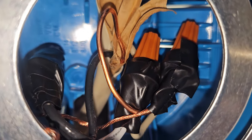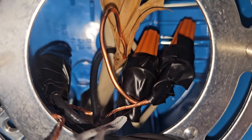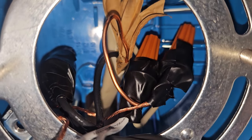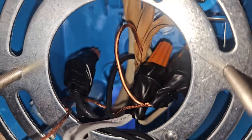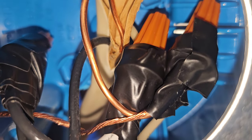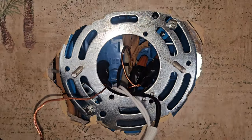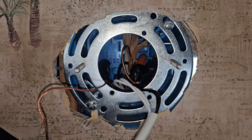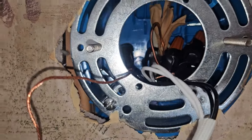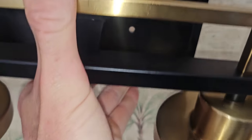You can see them inside right here. Because this light fixture has two whites and two blacks, I tied all the blacks together, the copper wires together, and the whites all together as well. I then put on the provided nut caps — the orange caps — and then wrapped them on the wires first, then going up the cap. What that does is it just prevents slippage out as you shove the wiring back into your electrical box. As you can see here, my bolts are nice and straight and ready for this to go on.